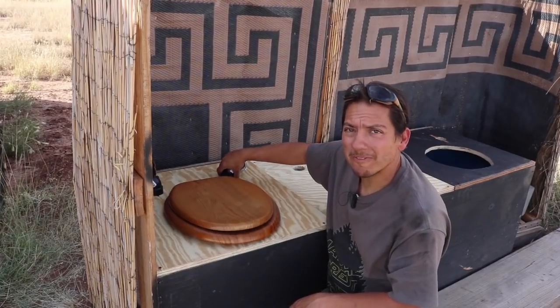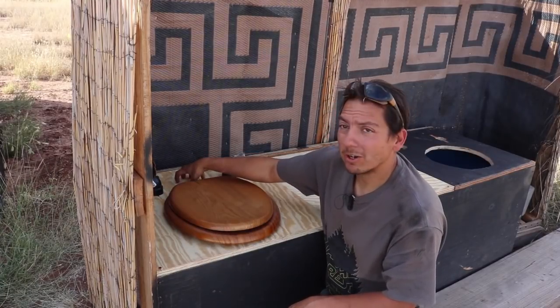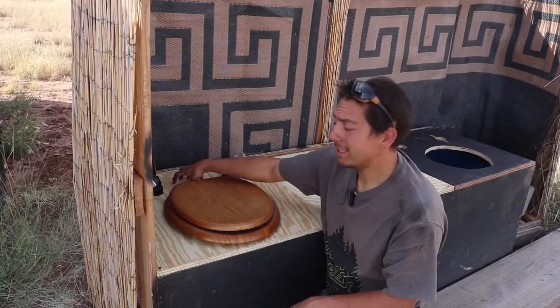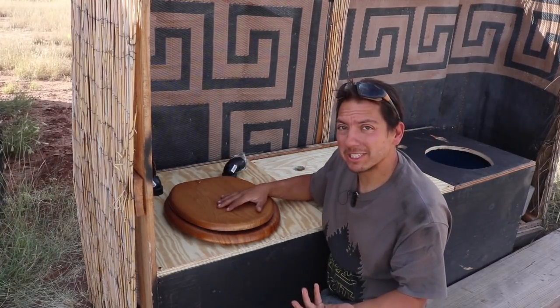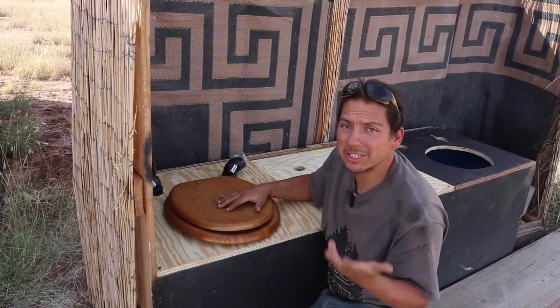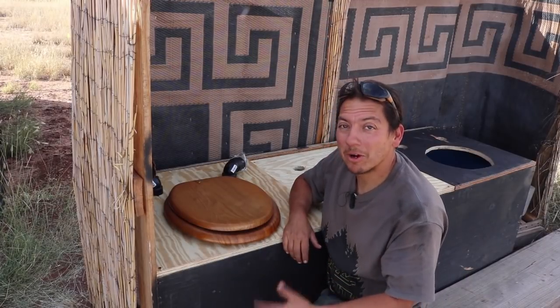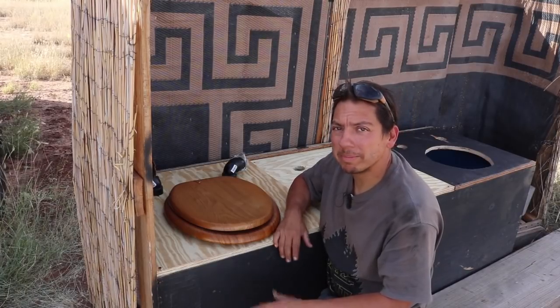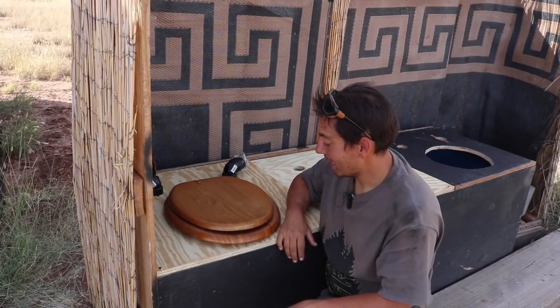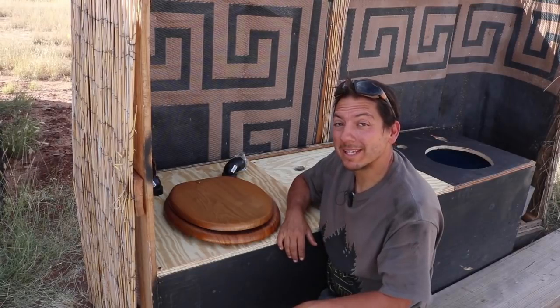Of course, I added two vent pipes in here, and if that's not enough, you could always put a third, larger vent that comes from the toilet up and out if you need it. Just some extra additions that you might want to think about adding to your build. But this is it, and I'm hoping that this little build here, quick, easy, I hope it'll pass inspections, and then we'll be one step closer to building the house.